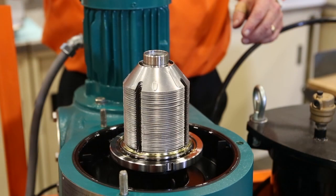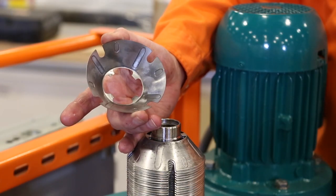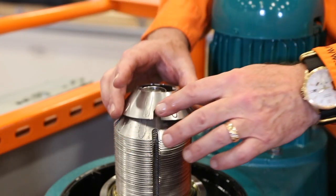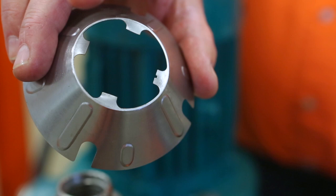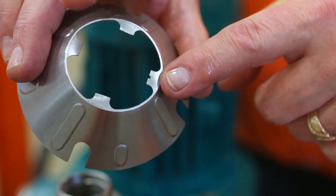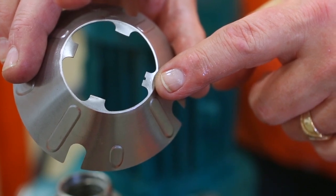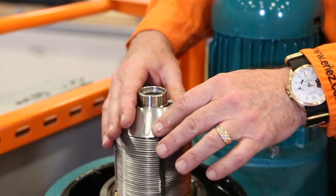The conical discs below the separating disc divide the dirty fluid into many thin layers to enhance the separation of tramp oils from the coolant. They help direct flow — heaviest down and out, lightest up and in. They also act like a spring, so when the bowl is assembled, everything is very tight. The discs all look alike, but there are actually two different types. If you look at the ID of the disc, on one of the locating ears there will be a small slit in half of the discs. When replacing the discs on the spindle, alternate the styles. They should stack up close to the top and allow you to push down on the stack a little.